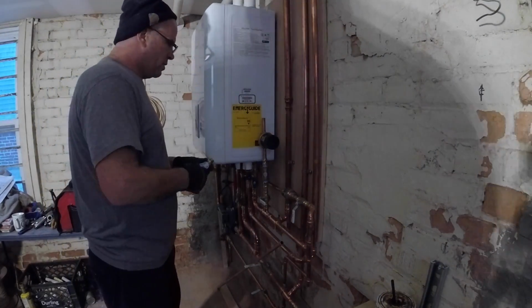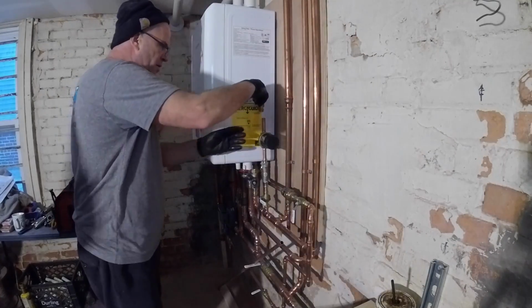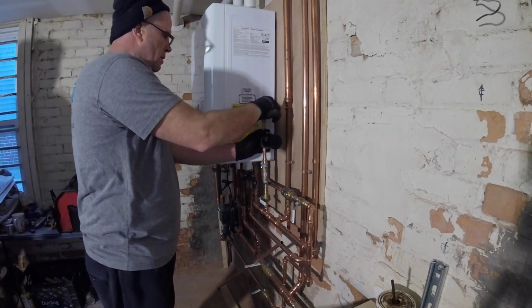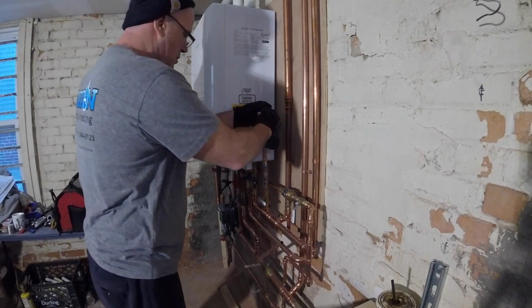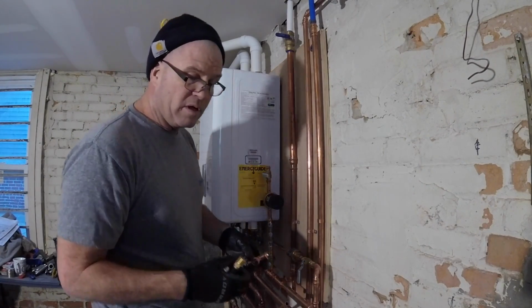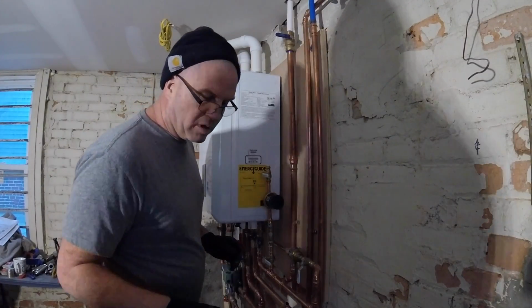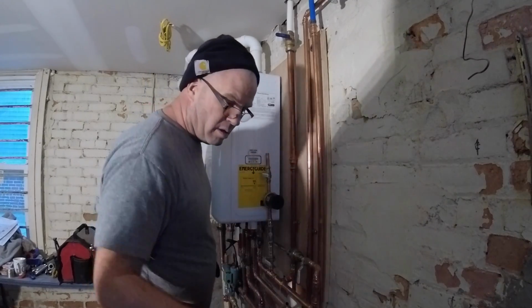Pieces there. There's our pump going towards the heater. Here's our other valve, right? Okay, Charles. Piece 2 inches of 1/2 inch. Put a female adapter on it. That's going to be our purge for the circle. All right. I'll go with this one here.